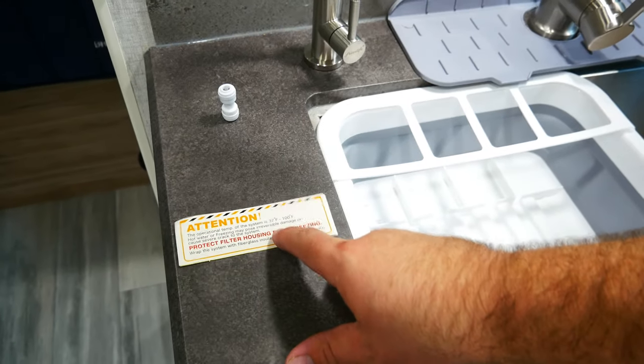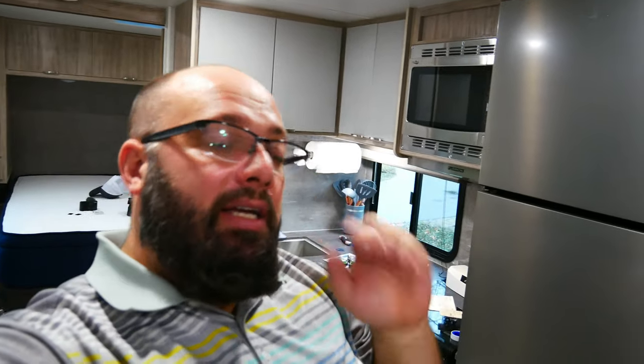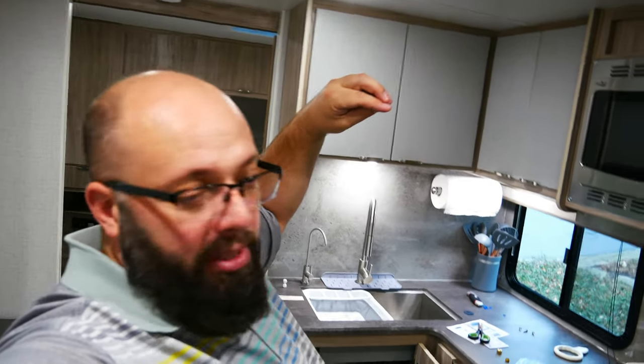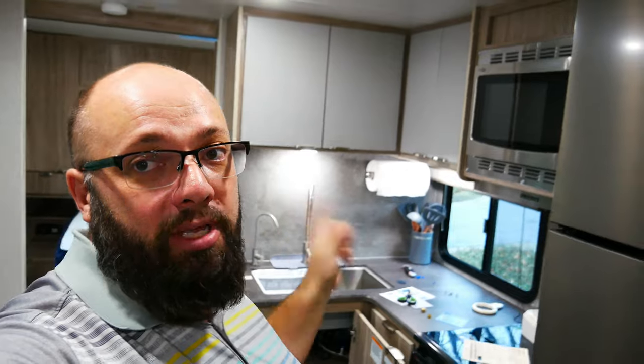Firstly, this thing needs to be winterized as well. If you leave water in here, it is going to crack and break. I do not winterize with the pink stuff. I just use compressed air. So what I do at the city water fill, I put an air compressor and I set it to 55 PSI, and then I go find the furthest water outlet, a faucet, and then I'll turn that on, and the PSI will push the water out. Same thing here. I will make sure there's PSI of air coming in, and then I'll just turn this on and I'll let it drain out of all the filters. It's been 2 years and I've camped in extreme temperatures, and I winterize on and off 3 or 4 or 5 times a year, and that's always been fine.